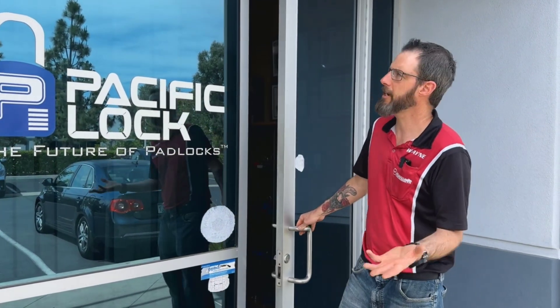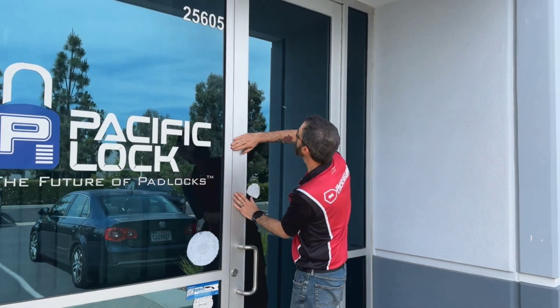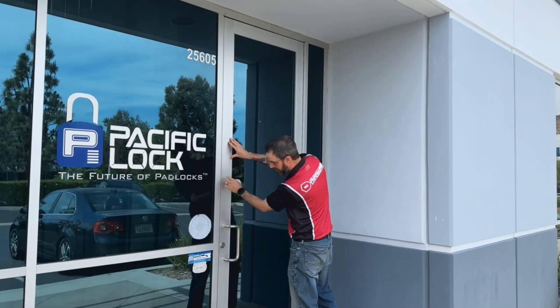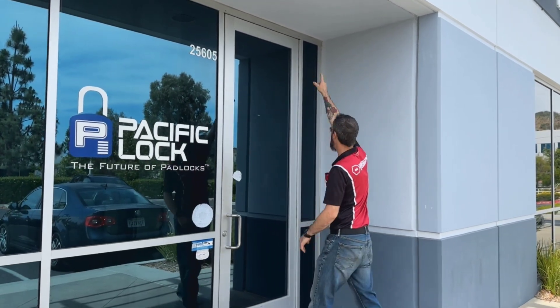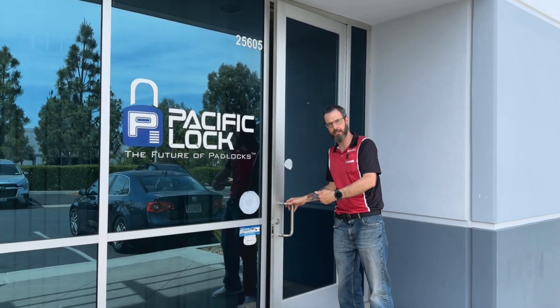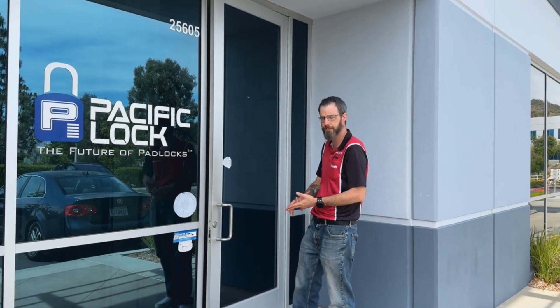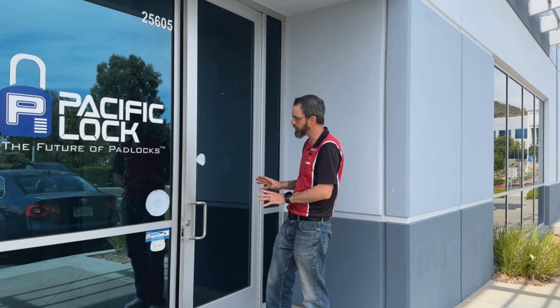One of the first things I want to do is make sure that we have a healthy opening. What I mean by a healthy opening is a nice reveal all the way around the door. This one does have a very nice between 16th and quarter inch gap reveal all the way around the door. We already have a continuous hinge on this side, so everything is really set up the way that we need it before we install our electronic access. If you have any kind of hinge issues or door closer issues, you're going to want to address those first before you start putting your access control on.